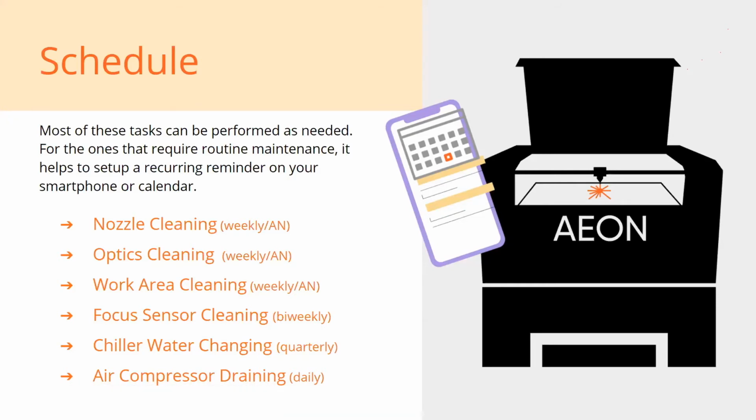there's no real evidence out there to say you need to change it this much. I remember there was a batch of lasers that went out, I think a year or two ago, where the metal used in the tanks was different. The supplier of the tanks used a different metal, and it was causing an algae bloom. So we had like a dozen Mira 7 owners who were experiencing a lot of algae growth. And they started changing their water very regularly, quarterly even, to keep it going.